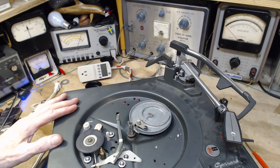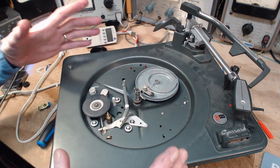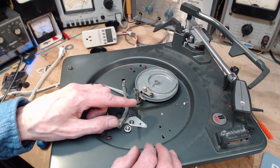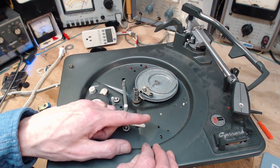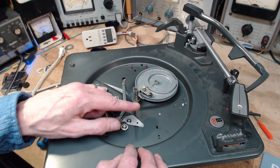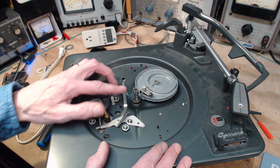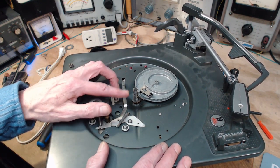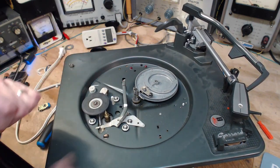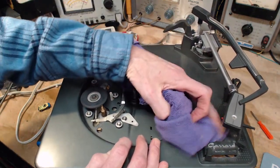If you look at old records, say from around 1920, these are really old records. These are big, heavy, non-vinyl records. If you look at the internal groove, it doesn't come into the middle. It actually goes back and forth, like when the tone arm gets to it, the tone arm does this, only slower. In those old record players, they detected the reverse movement of the tone arm. When the tone arm went the wrong way, they knew the record was over and it would pick up. But these ones don't work that way. They work in a different way. Velocity sensor.